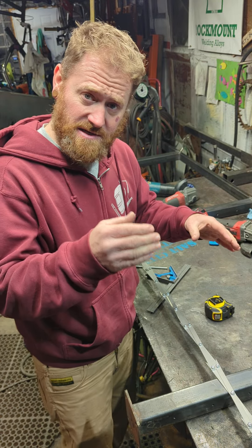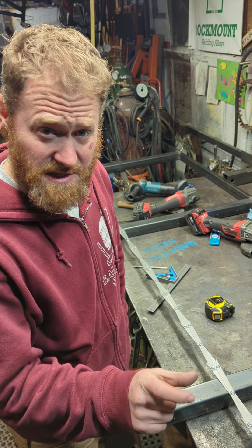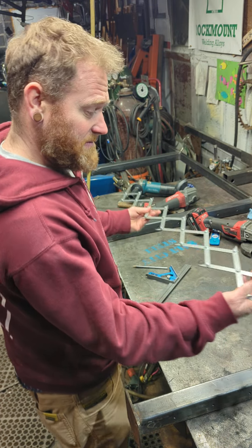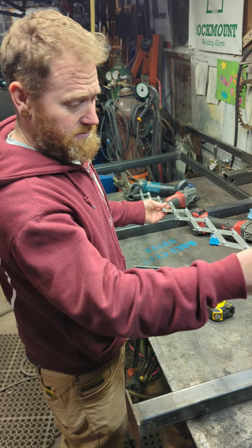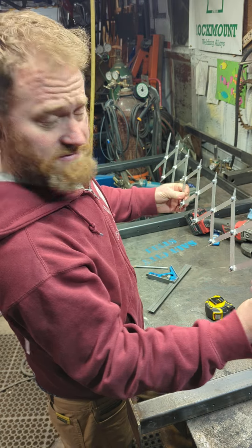Really good for railings — four inch on center with pickets up to two inches, two and a half inch pickets for your flat railing. If you want to do a pitched railing, you can't go quite that big, but you can do a one inch picket. On a big pitch, you got six inches so the spacing transfers out — you're good to go.